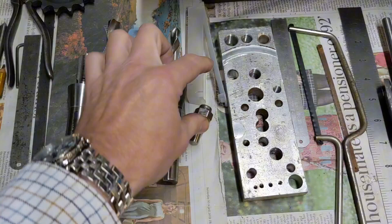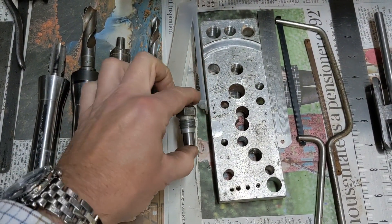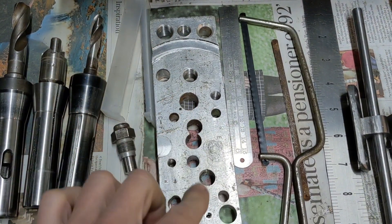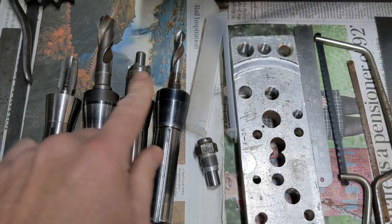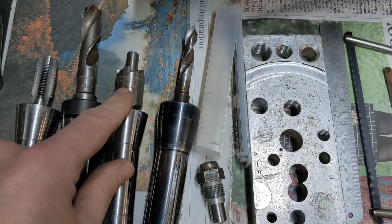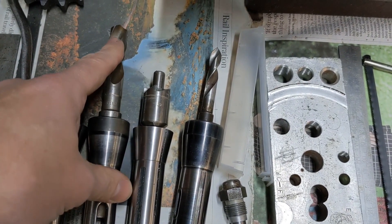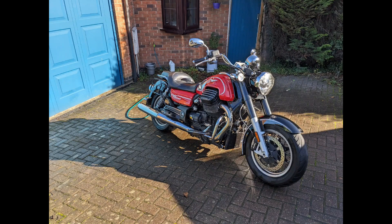The detent has a thread — we've been cutting a couple of trial threads there. It's a 16mm metric fine, even though it's from a Norton gearbox, so we bought a tap and we've been trying a few trial tapped holes. We've got all the tools lined up here to do that: the tap, pilot drill for the spot face cutter at 3.8, a spot face cutter, then we drill the tapping size drill and tap it. We've done the test piece and we're going to put that into the gearbox so that we can have a detent.